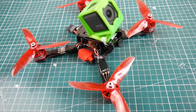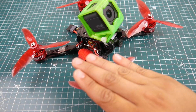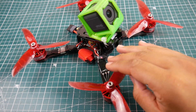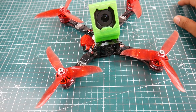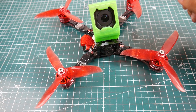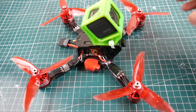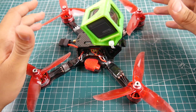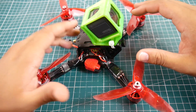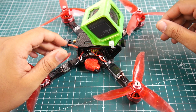Overall this is a success of a budget premium build — basically the best bang for your buck. Everything in here is pretty spectacular. If you're looking for 2500KV motors, these are not 2500KV — I'm considering them 2300KV with a lot of torque, and the torque is awesome. I'd recommend them if you're looking for something very powerful in a lower KV range. They were pretty efficient, didn't heat up, and I had no weird oscillations. I just built it, set up my modes and rates, and went and flew. It's also a very good starter build — and at any point if you want more performance, just change the motors, because everything else here is premium.